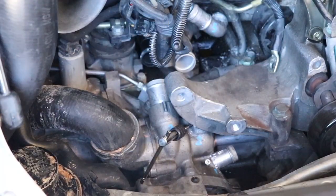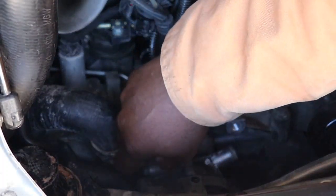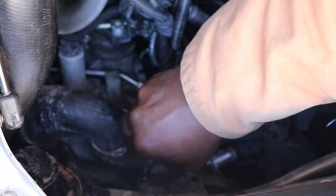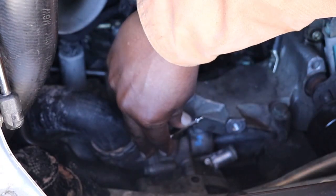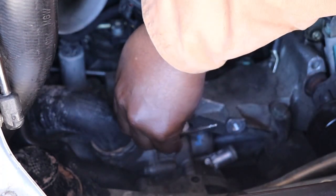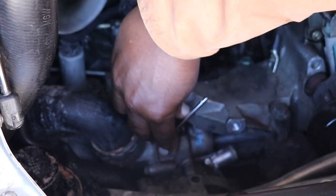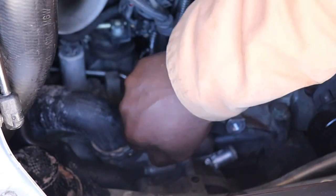Okay, so we're going ahead and tap this one, number two. Nice and easy. Before we use this tap, we went ahead and brushed out all of the shavings from the previous tap. So you have a nice clean tap. And then I put a couple drops of oil on it again. And then we start nice and slow with good firm pressure and a nice square pressure into the hole so it bites, and then you just turn it on through like so.